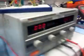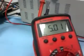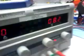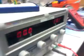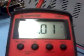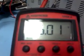So quickly, I'm going to show you. Here we can see that this sensor 2 here is powered by a power supply unit, and I put a voltmeter onto it just so you can see the voltage in the circuit, because it's going through a 5 volt regulator. If I just up this a bit here, maybe 8 volts. Here 8 volts is on the initial circuit, and going through the 5 volt regulator on the main circuit is 5.01 volts. So I want to reduce.